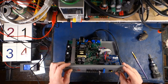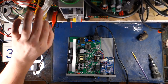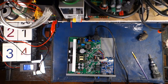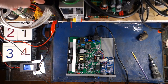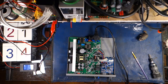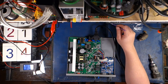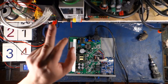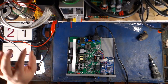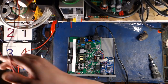Now let's connect the load. The load I have here is that PoE switch that I modified a little while ago. It's 48-volt — it'll take 54 of course. And I've got two Cisco access points, kindly donated by Joe Miller, and an M2 feed horn on an adapter. Let's hook this thing up and put some load on it. Something to keep in mind: it doesn't necessarily have positive and negative per se, but there's a cheat where it says negative. Since this is actually a negative 48-volt power supply, the zero volt will actually be your positive and the 48 will be your negative.